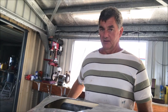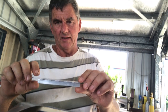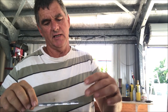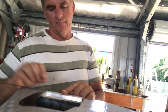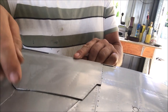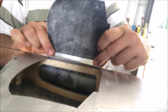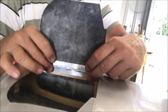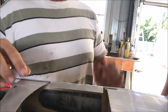We did go to Dubro-type hinges and again that sort of worked but wasn't overly robust. So the latest thinking is, like most things, make our own. We're making our own piano hinge — half-mil aluminium cut on the CNC. That half-mil aluminium from Bunnings will go in there, sandwiched in and sunk down one and a half mil, and that'll become the hinge for the clamshell gear door. We'll put little holes in it so when we glue it in it keys properly. A bit of work to figure out the mounting, but we've got ideas — it's a work in progress.